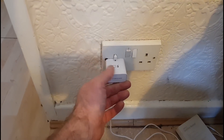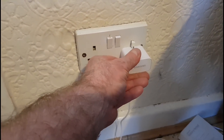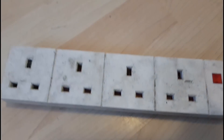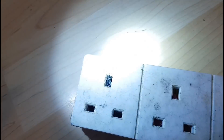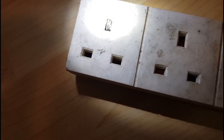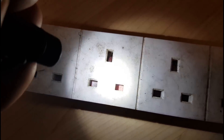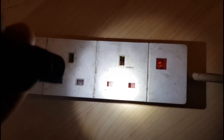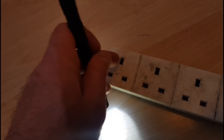I've just found a phone charger on the floor and you can see how the screw might interfere with things. Now there's one thing I noticed on a couple of extension leads — this being the main one; I've already dealt with one upstairs. The first three sockets are okay but on the top one, if you put a torch to it you can see that the earth pin has snapped in. It's plastic rather than metal but it's still a bad thing: these have a safety shutter device where you need to put the earth pin in the top for the bottom two to open, allowing connection to live and neutral. Because it's been wedged open you've now got two live connections exposed — anyone could just ram something in there and potentially get shocked or worse. It's the tenant's extension lead, so I'll make them aware of it.